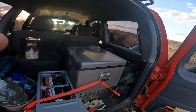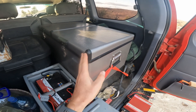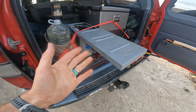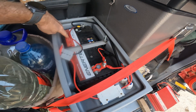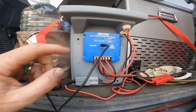My hack job I made myself - that's what I want to show you. I've got a 90 liter dual National Luna fridge, which takes about six to six and a half amps. My old Victron 5 amp solar controller was not enough to run this - I used to travel with a 40 liter Engel fridge. So I took my old National Luna battery box, just the plastic box, and fitted a normal 105 amp hour deep cycle battery.